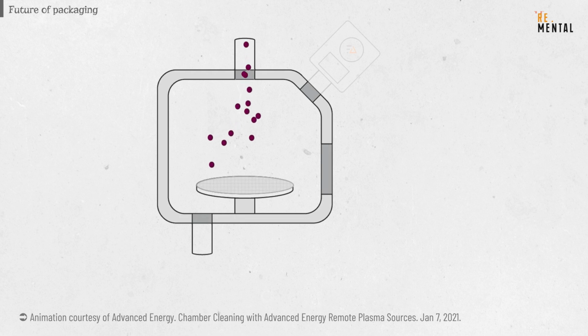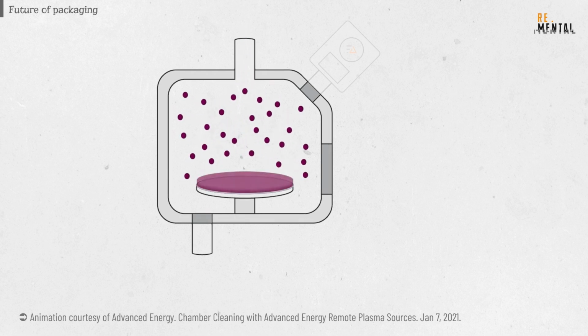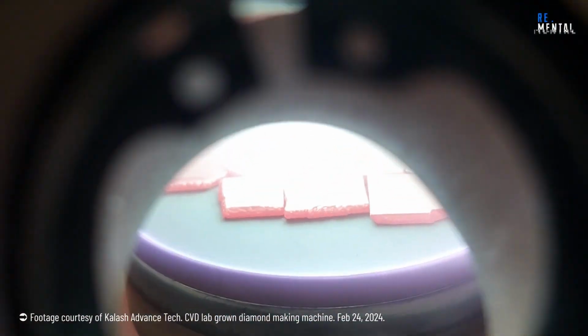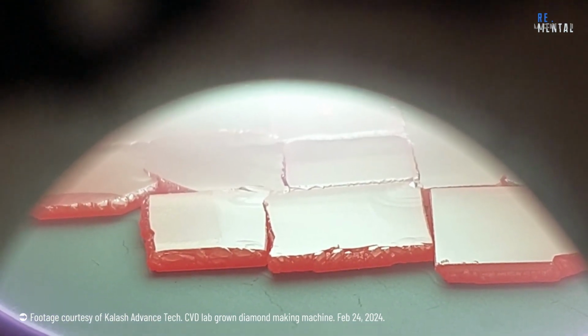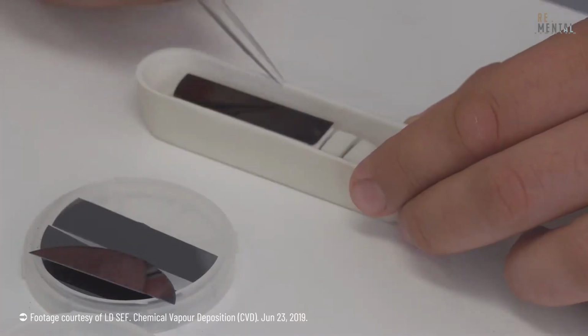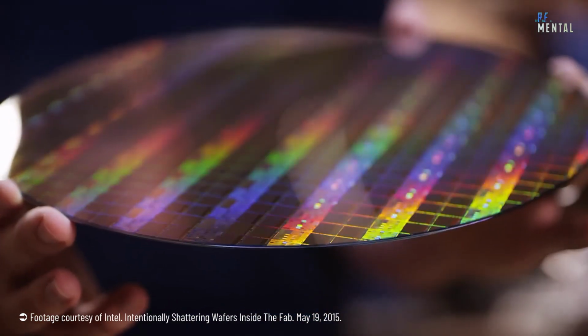And finally, CVD, chemical vapor deposition coatings, in which a usually solid material is turned into vapor. Then this vapor is deposited over the desired surface. This is done in chambers at high pressure or under vacuum. This creates high-quality solid thin films and coatings. This is the most complex and difficult to implement because of the use of these chambers, currently used in the semiconductor industry.